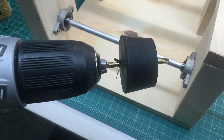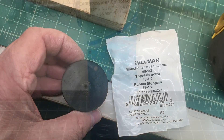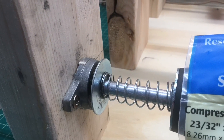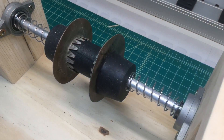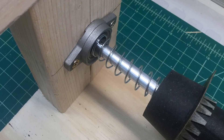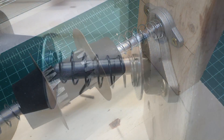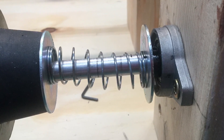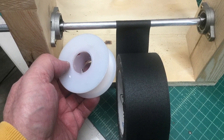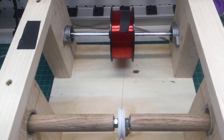After a little brainstorming, I elected to use these rubber stoppers — drilled holes right at three-eighths of an inch in diameter to match the aluminum rod. I have some springs inserted, placed on each side of the bobbin, and I'm actually able to use the rubber stoppers up against the form factor without needing to make a dedicated spindle for the receiving side. I'm also using some tape on the aluminum rod itself to build it up and create a nice spindle for the wire spool to feed off of.